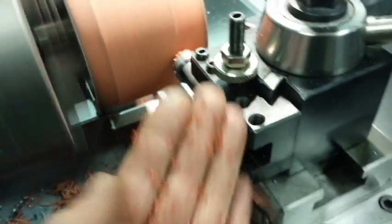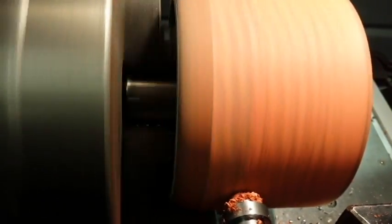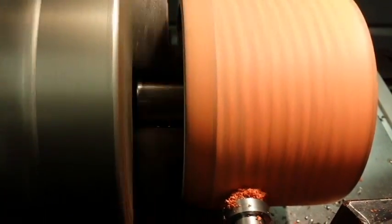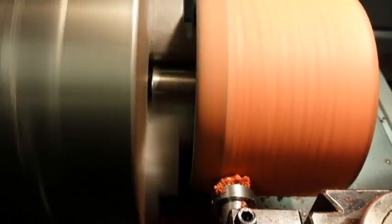I'm rolling at around 370 RPM. This pass will finish, and you can see since it has a pretty wide radius — my depth right now is probably like 15 thou I'm pulling at a time. I'll turn it off as soon as it's finished and then we can have a look at the surface finish. Right now I'm on a coarse cut, as you can see — my travel is pretty fast, but then again it's a tool with such a wide radius.